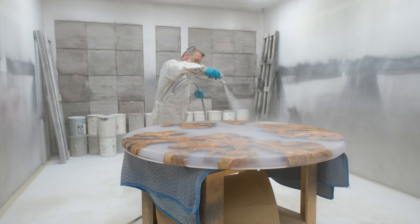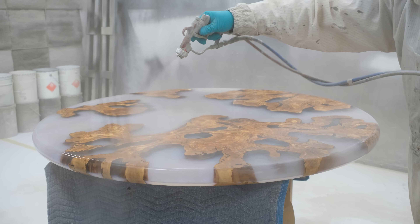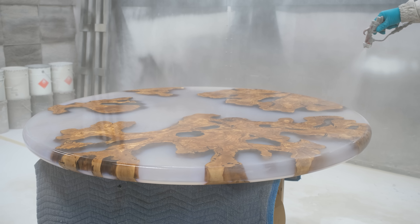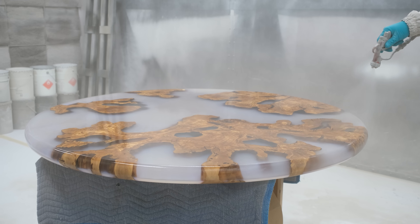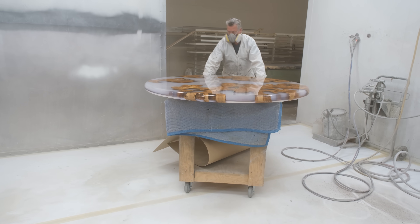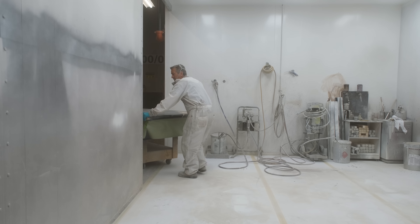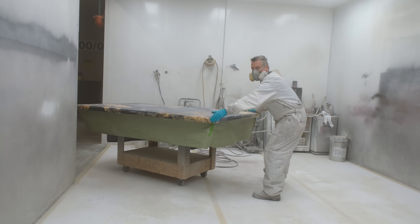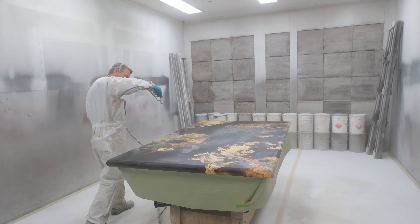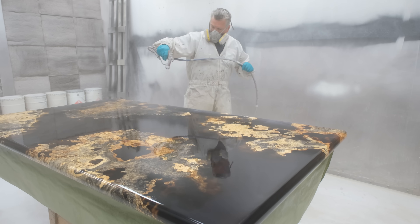Since this client is going to be using this piece quite heavily, he opted for the acrylic urethane finish for maximum durability. The only downside is that it forms a layer over the wood and you can't really feel the wood grain anymore. But if you don't want to do any maintenance and just want to use it without worrying, we do recommend the acrylic urethane. As an alternative, we offer Black Forest Furniture Oil in combination with Black Forest Ceramics — this finish offers the best of both worlds: an acceptable level of durability while still letting you feel the wood grain. It can leave stains if you let spills sit, but it's the kind of finish where you can easily maintain the piece, remove marks, and have it looking brand new. It really comes down to client lifestyle when choosing which finish option is best.